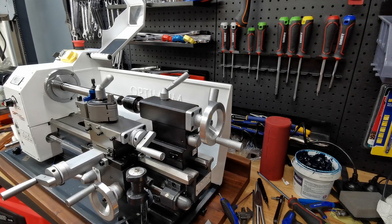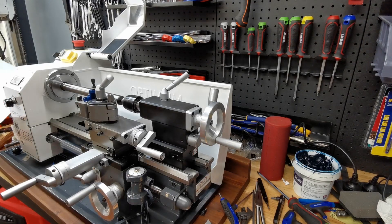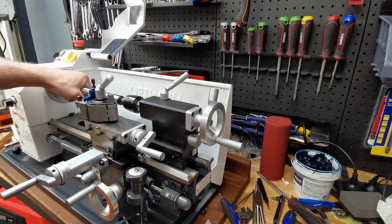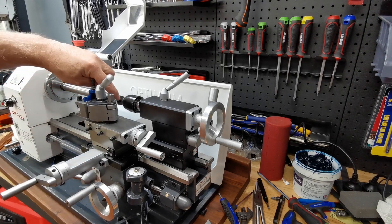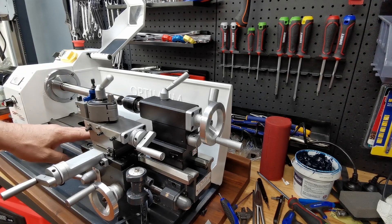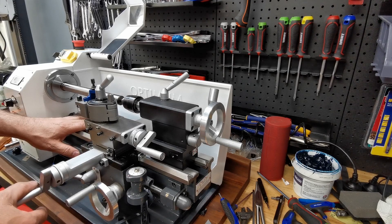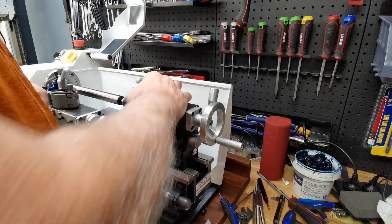As I say, when I go around YouTube looking for this, hardly anyone's talking about that. They're all just talking about using those screws to go left and right, which is a big deal — that's the easy thing. But what about up and down? If that's not perfect, then why would it be perfect? And so that bar makes sense to me now — it's just a sort of a nice parallel bar. It doesn't have to be perfectly straight because the hole is what matters. And once you've got it stuck in your tailstock, it's got to be straight, it's got to have no runout, it's got to be parallel to the bottom here — which means it's parallel to the cross slide all the way along. Bloody fantastic, mate. Couldn't be happier.